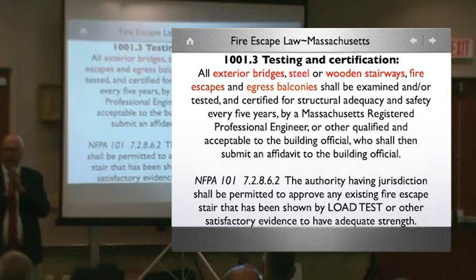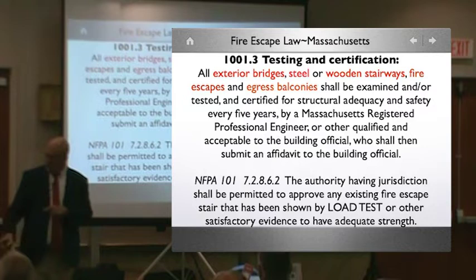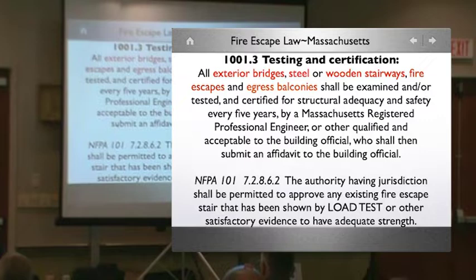A thinned-down bolt. So this is what you guys got to remember, is why fire escapes are bolted, not welded. And anybody that comes in and takes an old fire escape and shuts it down with welds without removing the rust, by the way, you think these guys will weld, remove the rust? Whenever they get a problem, you can see it right here, the guy has a 3/8 rod because there's so much space between the metal and the metal. They bridge it.